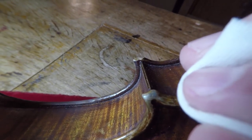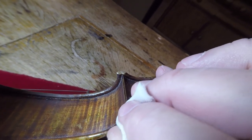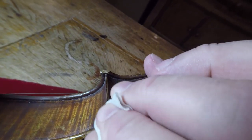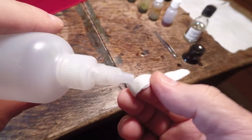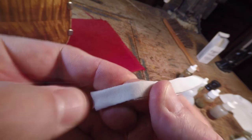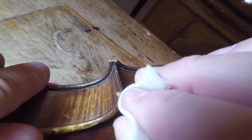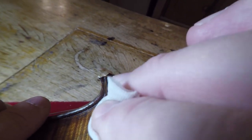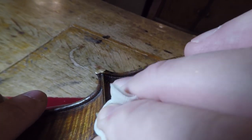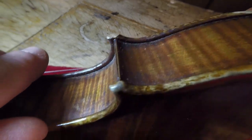This back corner worries me, because it looks like someone touched it up with something synthetic without removing the rosin first. Also, you shouldn't use any cleaner other than alcohol before sealing up the wood, or it usually seals whatever is on the wood into the wood forever, which makes this violin an even better example because it's not coming off. And now we're going to have to get really serious. And the other back corner has the same problem, just not as bad.